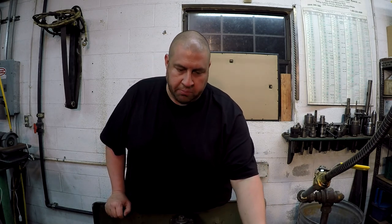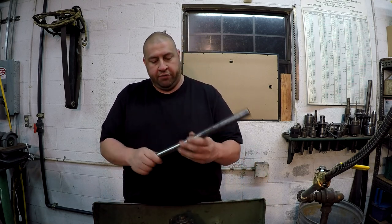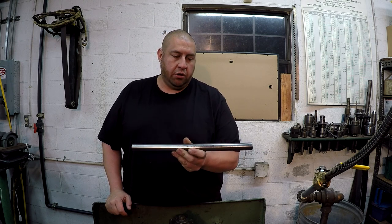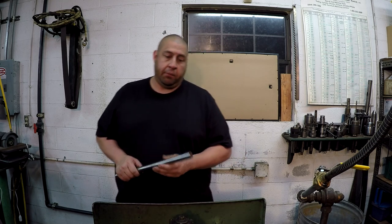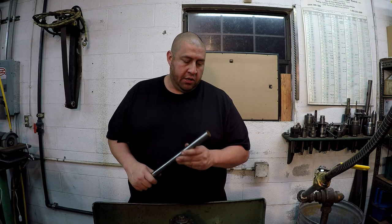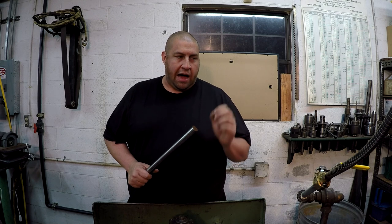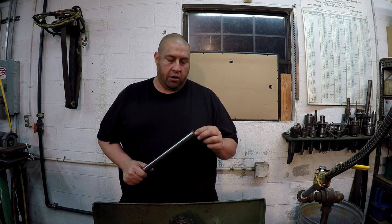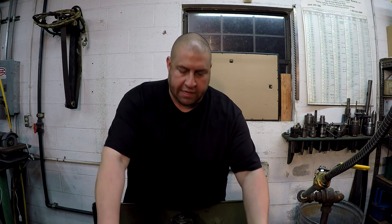So since we're going to be using a piece of 1 inch, that's the largest diameter. I've got a piece of 1 inch here that I've cut and just kind of buffed it a little bit. This is some stress proof, so it's easy to machine. It's a free machining material. I think this will work out pretty good, because the one issue that I have, and I hope it ends up not being a problem, is the small end is only 0.1 or 100 thousandths in diameter. So that's a pretty small center down there on the end, a small diameter to get to. I think I have a center point that's small enough to work. I've got to check that. I've got it up in a toolbox and see, but we're going to try to work around that if we have to. So that's it right there.